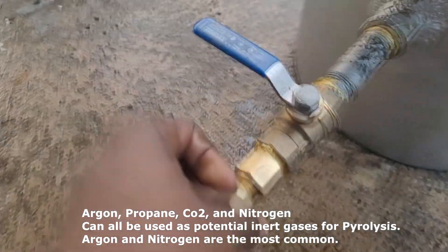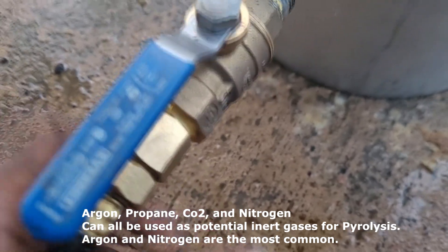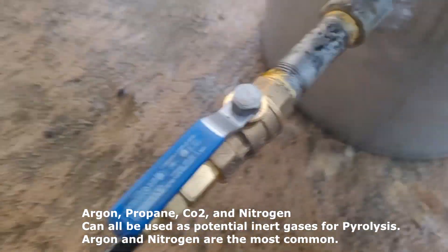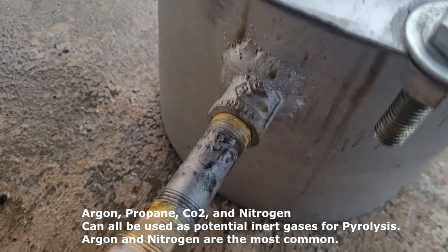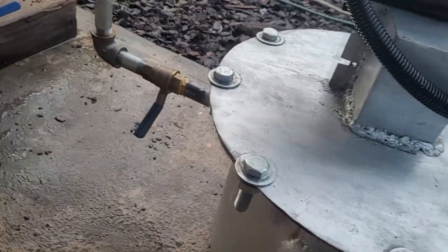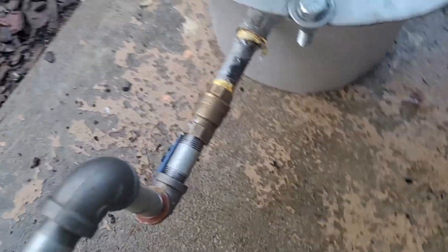I have this port here. I'll open it and run the gas in there. Flushing the oxygen out also serves as a leak test — you can spray something around the seams and see if bubbles form, or you can hear major leaks squeezing out. That way you're not leaking the actual bad stuff. On top of that, this gas will also act as a carrier gas, helping push the pyrolysis gas out through the bubbler system since it sometimes doesn't have enough pressure to run on its own. I open the inlet port and the exit port, and run the argon inert atmosphere through. You can hear it running and coming out.